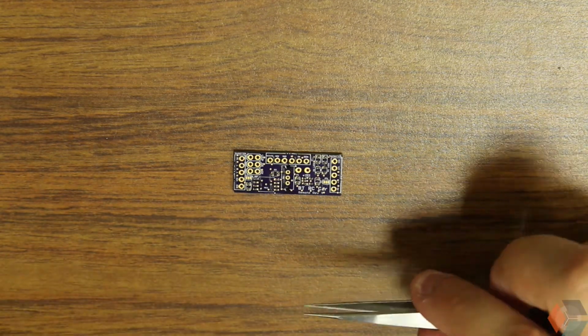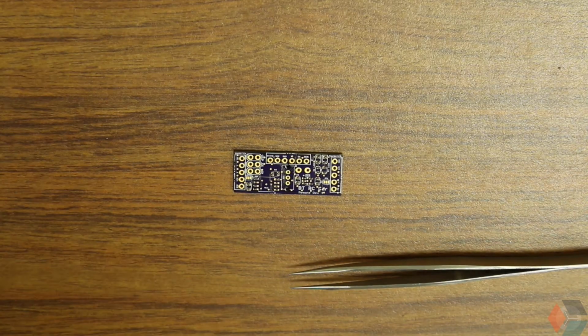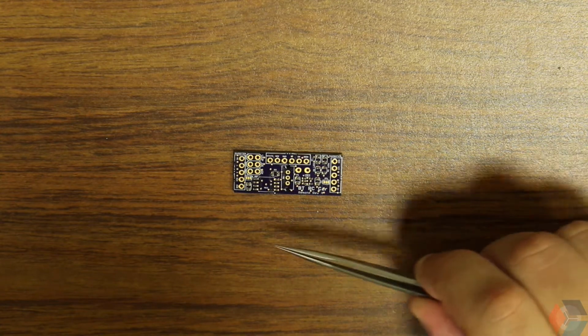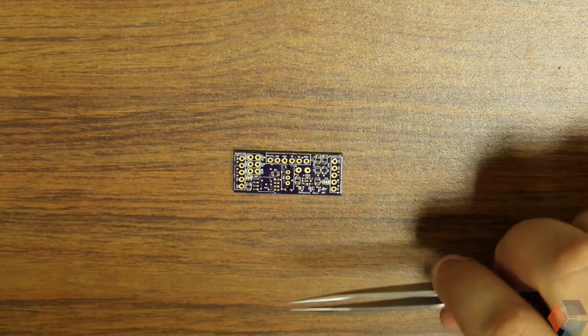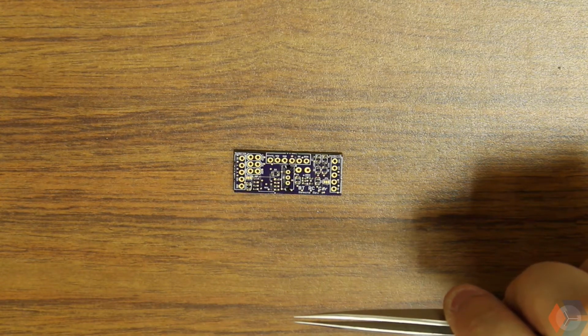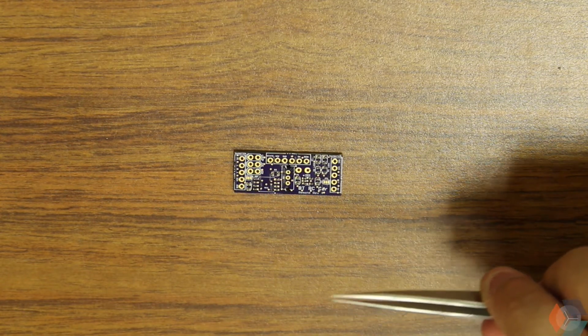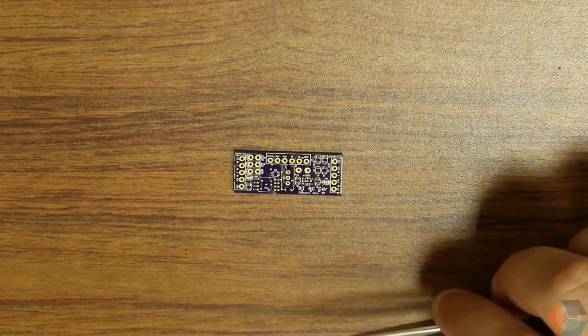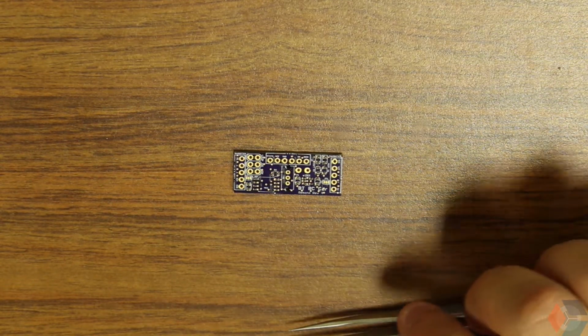The reason why I got these ones is because I do some 0402 components, but we're only going to do 0805. So, it doesn't really matter where we start. I'm probably going to do some of these more passive components, and also off screen here I do have the schematic open on Eagle. You can also make a printout, probably easier than having your computer out on the table, but you should follow along with that just to make sure you don't misplace anything.